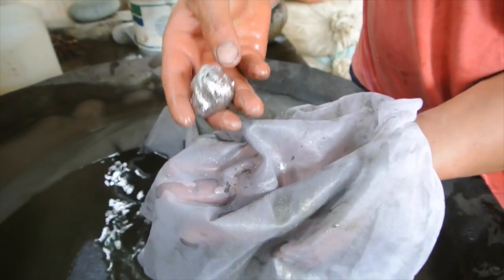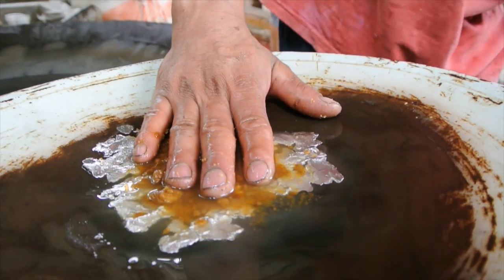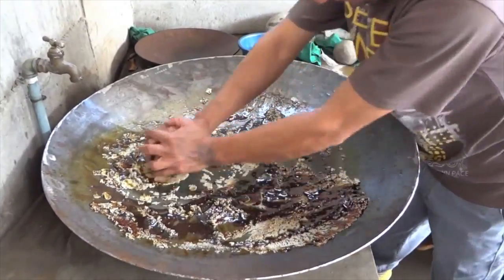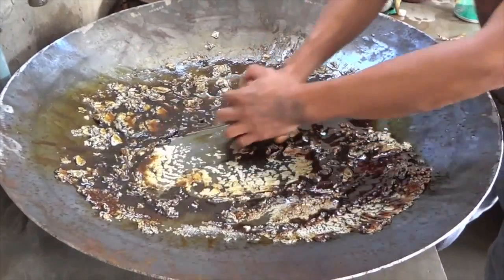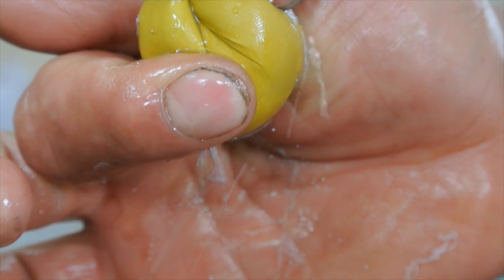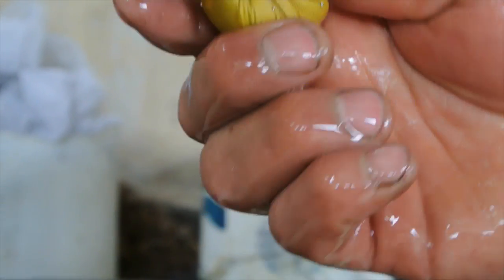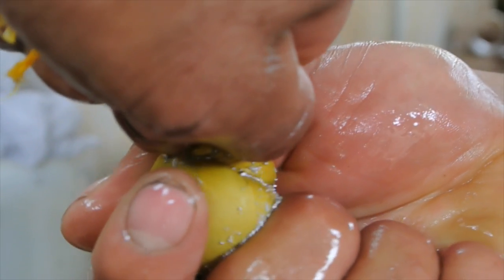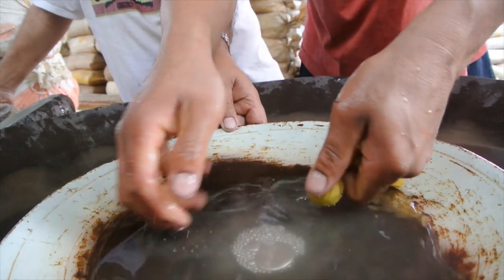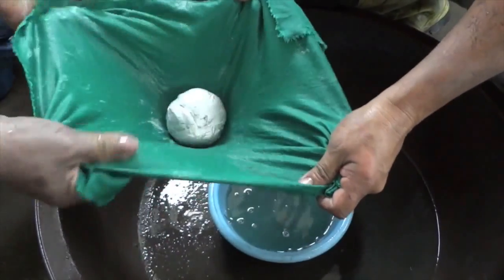An amalgam is a mixture of gold and mercury that forms a semi-solid structure. The more mercury there is, the more liquid the amalgam becomes. Miners take advantage of this by adding mercury to the amalgam, making it more malleable and easier to clean. Sugar is added, just as they did in the chancha, because they believe it helps clean the amalgam, increase mercury's capacity to bind to gold, and ultimately increase their overall yield. Once the amalgam has been cleaned, it is squeezed in a cloth to remove the excess mercury, creating an amalgam that is nearly 50–50 gold to mercury. This process ensures that the miner, everything they touch, and their workspace is covered in mercury, further contributing to site contamination and increasing the health risk to miners. They take care to squeeze every last drop of mercury, which they collect and reuse.